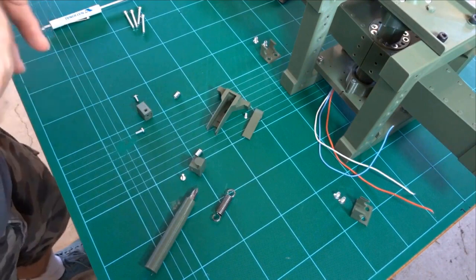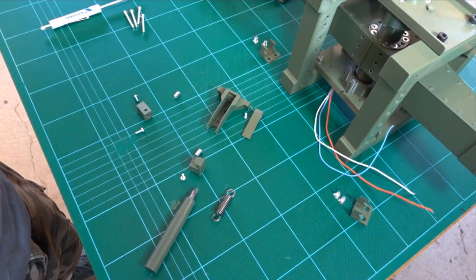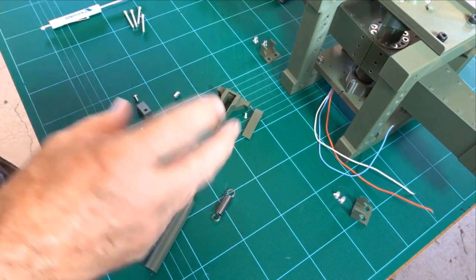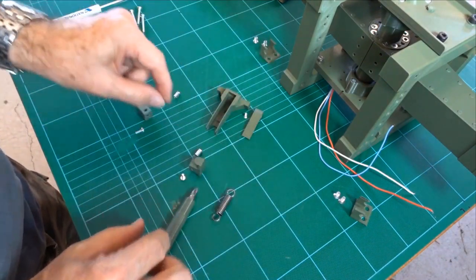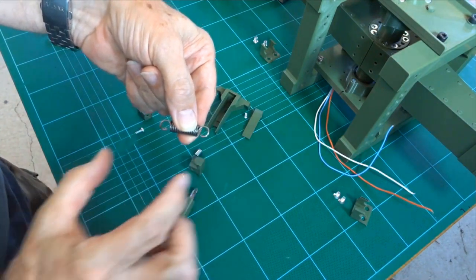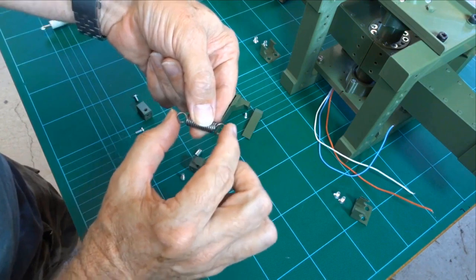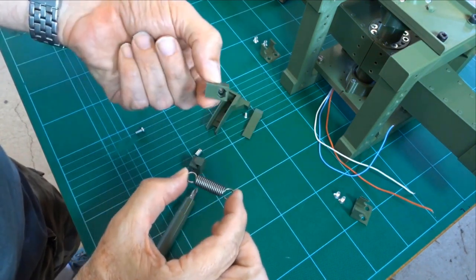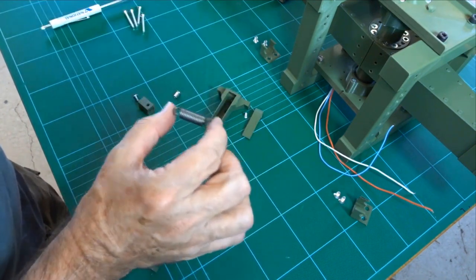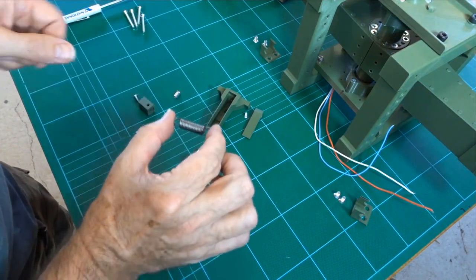Okay, in this section we're going to be assembling the springing mechanism, which is kind of important for these rudder pedals, make them self-centering and sprung. So these are the basic components. I've got a 40mm from the outsides spring. I think the official AuthentiKit ones come 38. I've got two of these, which are two different lengths, so just measure the outside. It matters a little bit when you're pre-tensioning it, but it shouldn't be a big drama.